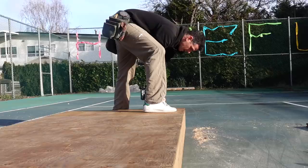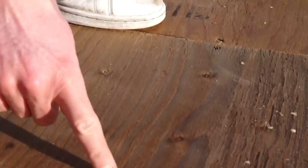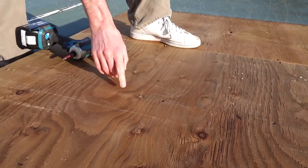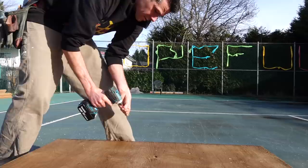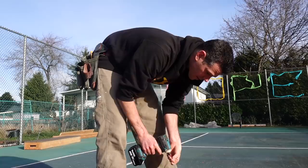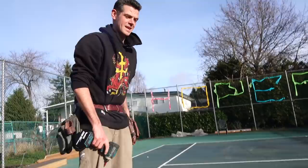I'm going to show you something about plywood. Plywood often has a manufacturing line on it — you can see there are factory lines here. Sometimes if you want to find a stud without drawing a line, look for a factory line. I know there's one about an inch away here, so with every one of these I'm going to go about an inch away from that factory line, because those lines are always square with the sheets. Especially when you're using a nail gun putting a floor system together, that can really benefit you. You can see I didn't miss for the whole thing because I just eyeballed it away from one of these lines.